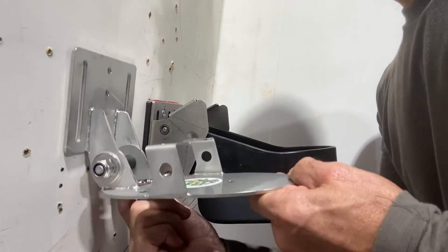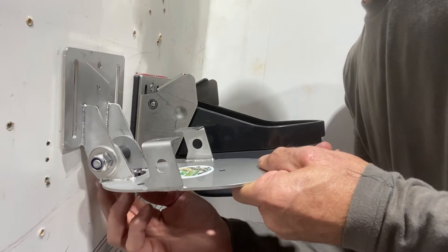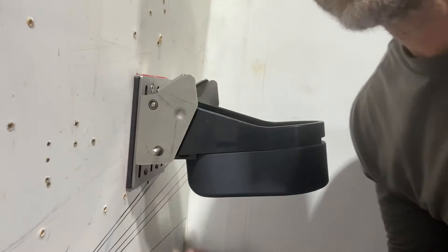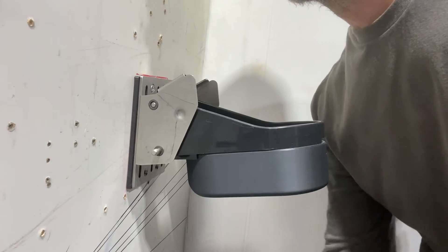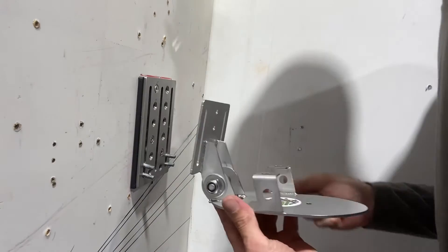The TM2, which is a lot easier to use and has a lot of features and benefits, sits a whole lot closer to the transom — almost 20 millimeters away. The transducer will sit 20 millimeters away from the transom on here, whereas on the MR1 kilowatt that measurement is like 60 to 70 millimeters. Then plus wedges, and you could be adding 90 millimeters of distance — where you really want to get that transducer as close as you can to the transom.